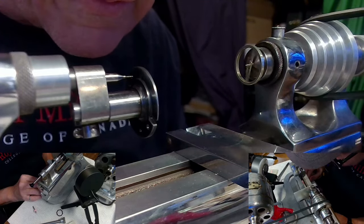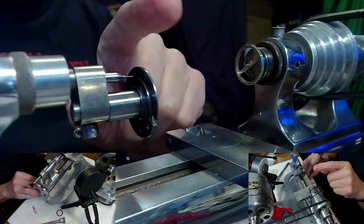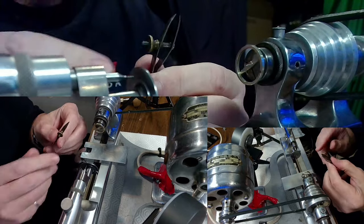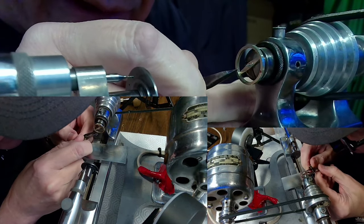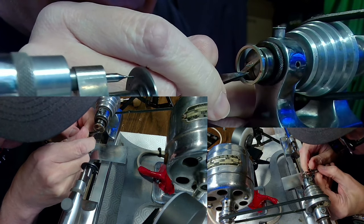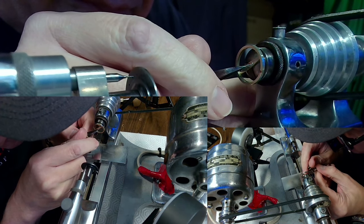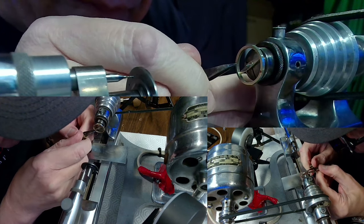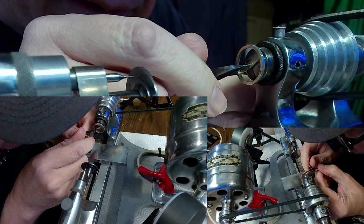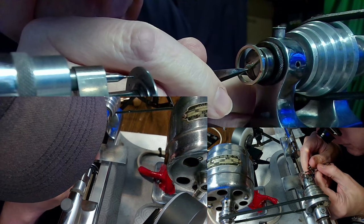The wheel is not absolutely centered, but I can remove the material on the end here — there's a little nubby that needs to be removed. I also want to make sure I understand the amount of pivot that needs to be at the very end, so I've got another fine tool and I can take a measurement from the end of this pivot going outward. That way, once the material is removed, I understand how much pivot needs to be sticking out the end.